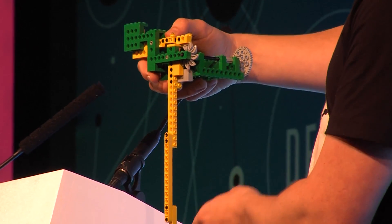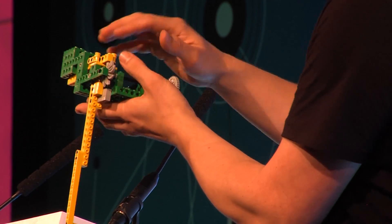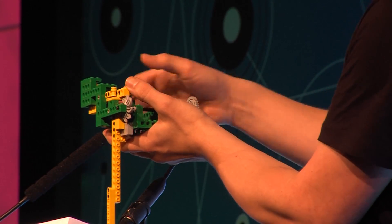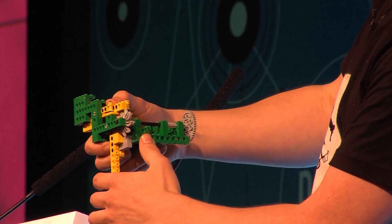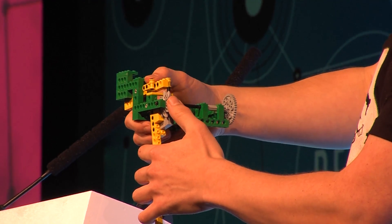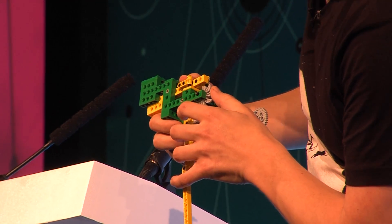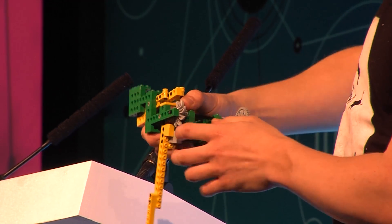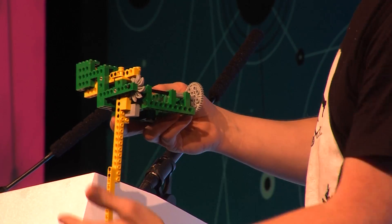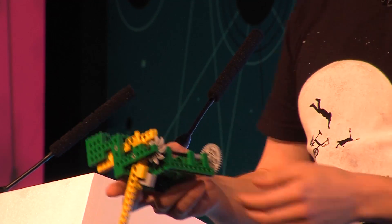There are four steps to this motion. When the pendulum moves over to the right, the first step is the gear can't move because it's being blocked — it's trying to turn but can't. The second part is the pendulum comes over and lifts up the beam, and because the power's going through this gear, it pushes it through. The third part is it can't move any further because now the gear is stuck by this little brick. Because there's enough power coming through from the weight, it pushes back on that brick and pushes the pendulum back the other way. The beam comes down, the pendulum's gone back, and now we've gone full cycle — so this is a repeating mechanism.